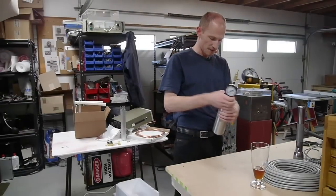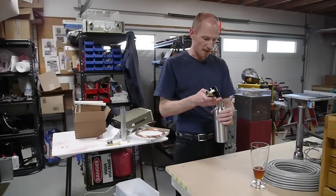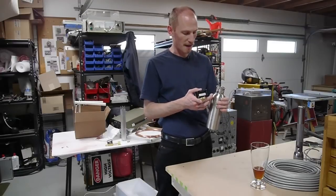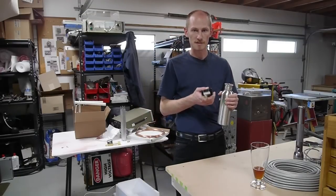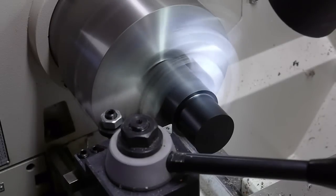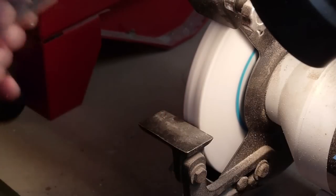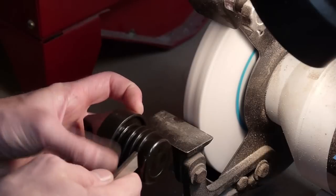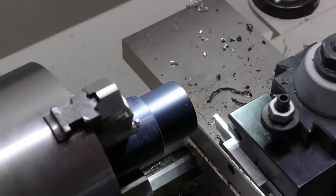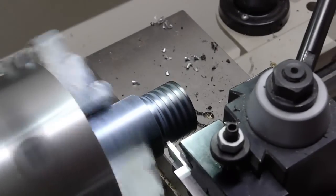So let me show you how I built this thing. This is a stainless steel water bottle that I got from the hardware store for like $10. The cap it came with was hollow, so I was kind of worried about modding it because I want this to hold 30 psi, and that hollow cap — we really wouldn't be able to use a pipe tap or anything in there. So instead I started with a solid piece of Delrin and turned it down and faced it. Then I got a parting tool and shaped it such that it matched the threads on the existing cap — ground it down and smoothed the corners a bit. Then I mounted the parting tool in the lathe and used it just like a threading tool. It kind of looks like an Acme thread, even though it isn't — it's just a square cut thread — and then threaded the part using the parting tool.